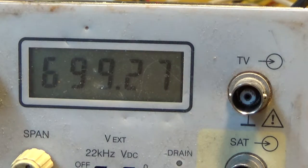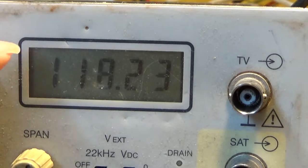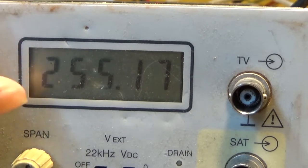On VHF, at 124 - this is VHF low band - it should get down to about 40-odd megahertz. Yes, 43 megahertz - that's good. All the way up, 169-170 megahertz - that's the low band. The high band goes right up to 470, so it covers basically all the way from about 43 megahertz completely up to around 863 megahertz.